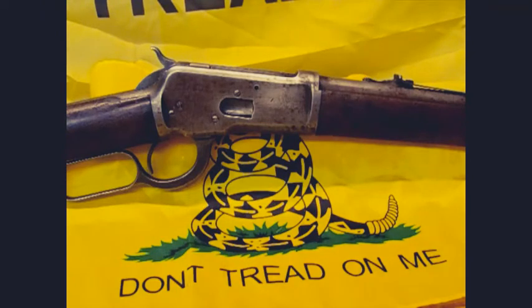Now, one thing this gun has had issues with as well is accuracy. The rifling is good in this gun, it's just very shallow. It's got some pitting to it, but that's not all that uncommon coming from guns from the black powder era. Always when you get a gun like this and you know you're going to try to either hand load for it or do something, you need to slug the bore. I'm not going to go into how to do that. There are plenty of videos out there on slugging a bore for your rifle. When I slugged the bore on this gun, I got around .312, .313 of an inch diameter.